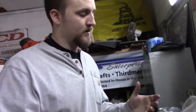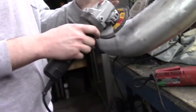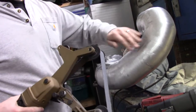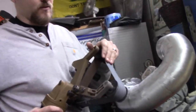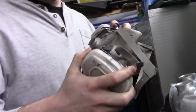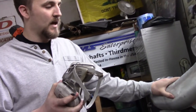What I've found to make this process go pretty quick: you take a grinder with a very aggressive wheel on it and grind down the welds pretty far, then come back with the pop sander and just get right after it to get it smooth. You can kind of see here what we've got done so far. I know it looks pretty rough but right now we're on a very coarse grit. We also cannot forget — definitely got to have our safety protection on. This aluminum dust is very, very nasty, so be sure to have some sort of breathing mask on. Let's get after it.